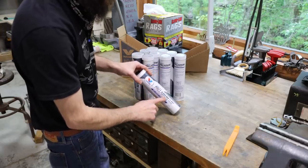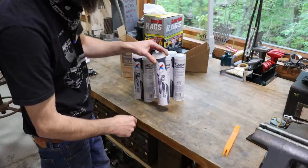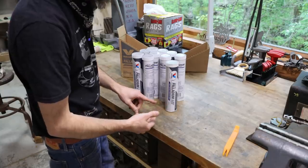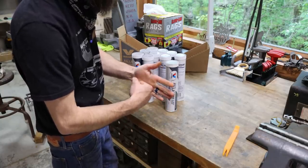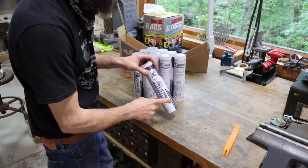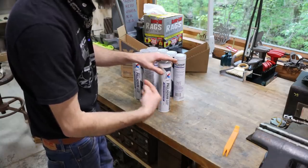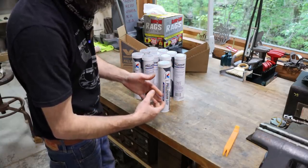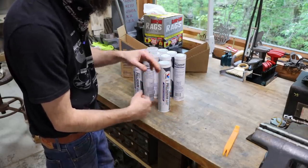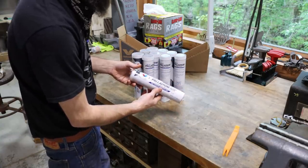The Valvoline Heavy Duty Palladium with the 3% Moly. Now, this is an NLGI number 2 grease that should serve our needs just fine in this gearbox. It's not high temperature, it's not high speed. There are 2 worm gears in there that see a lot of shear, and that's why I decided to go with the Moly. And check out the Moly if you're curious. From my best understanding, it's like platelets, naturally occurring elements, really small and good for shear or high load applications. So this stuff should last and serve this gearbox for a long time.